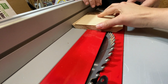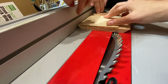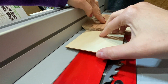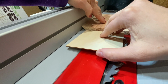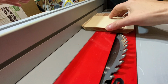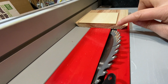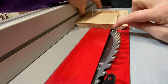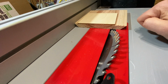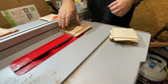It's just got to line up with that. Okay. There. It's going to be inside the corner of the right. So essentially, we're talking about having the shelves here, and because the angles all line up to make the interior of the box, what we actually measured for was there. But then accounting for the dado blade cuts that we need to make, we put it in about 1/4 inch so that then the sides will be the correct width. Or so we hope. We hope so.